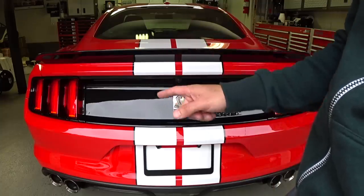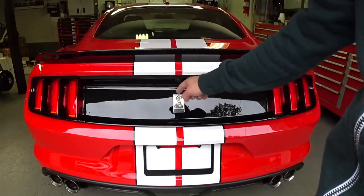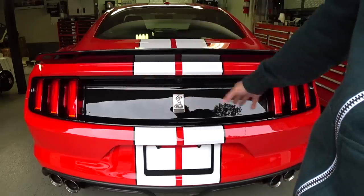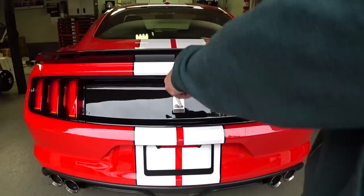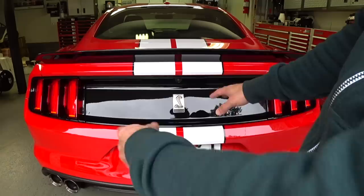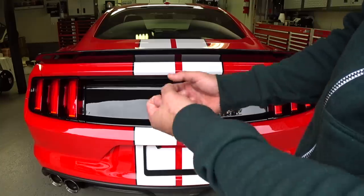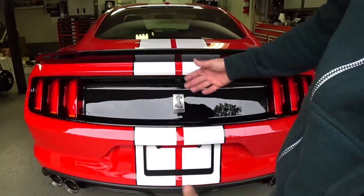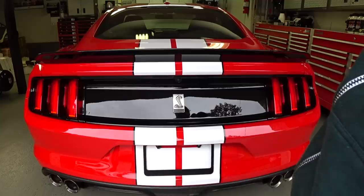Before we go further, I want to explain up front — this panel from the factory is not factory painted. This is not a base coat, clear coat. This is injection-molded with the gloss black finish as a very thin layer as it comes out of the mold. They spray the finish, usually in powder or liquid form, into the mold. As the plastic gets injection-molded and heat-exotherms, it bonds to that sprayed layer. As it comes out, it's a finished part — it eliminates prep, eliminates paint, and for mass production, that's just how it's done.